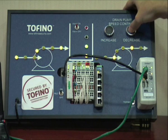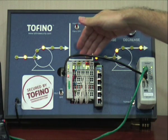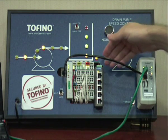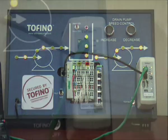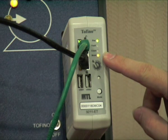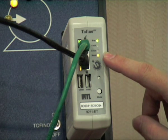Pressing the decrease button will decrease the drain speed and eventually bring it to a stop. The PLC in the center is programmed with a PID algorithm to control the inflow pump in order to maintain a certain level inside the tank. Next to the PLC is a switch which is currently not in use. The PLC's Ethernet connection is connected to the Tofino security appliance, which is currently set into the so-called test mode. We see the flashing mode LED.